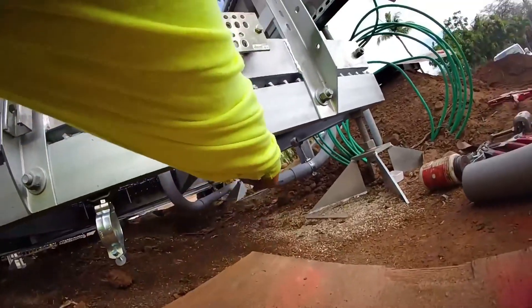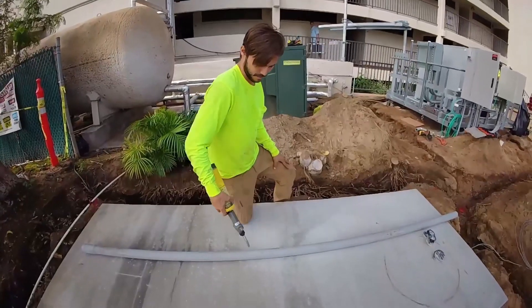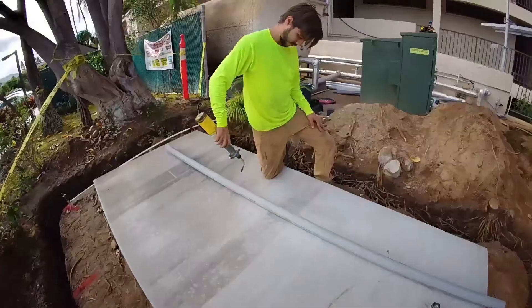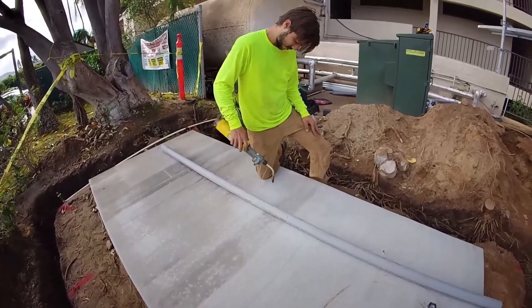We're in the process of heating a piece from there to there. I've got Telus working on the rest of that conduit run. We're just hearing from the mobile guys' project manager — they might make us redo the whole conduit run in a different direction, so I'm going to try to prevent that from happening. While he's working on that, I'm going to start driving these ground rods and running our ground ring.